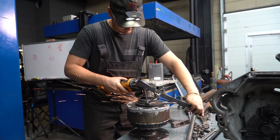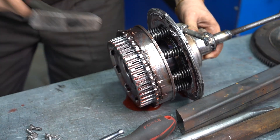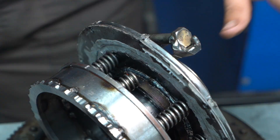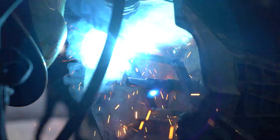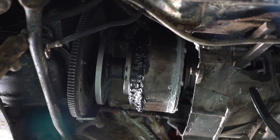Here's where we're at: while this was still on the bench, it seemed easy to actuate, but as soon as we got it in the car, that's when the trouble began. Either the clutch isn't fully releasing, or the fork gets bent. All we got is six tiny springs, but they exert a lot of force. We were bending the fork, breaking the bell housing — there were a lot of issues. But we were able to get everything to work, so let's bring the car down and proceed to do some testing in the field.